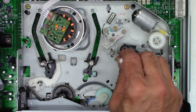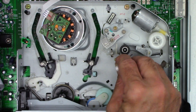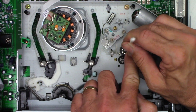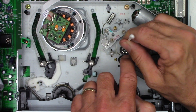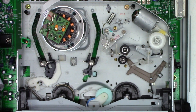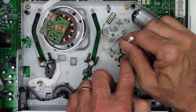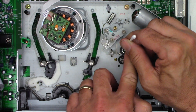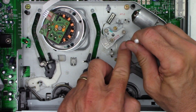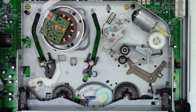Another new end of the cotton swab and I'm going to scrub the capstan shaft vertically, because it's too hard to scrub it rotationally. Now for the pinch roller — this is going to require a bit more pressure. This pinch roller is in very good shape with very low hours. You can see how much came off. I'll use two or three complete cotton swabs — six scrub ends total — on the pinch roller, to make sure I get every square millimeter cleaned. Six cotton swabs total; I'm very happy with the results, it looks mint condition.